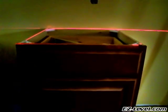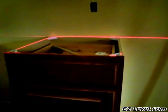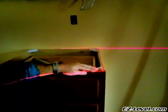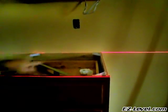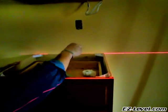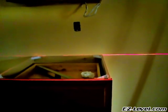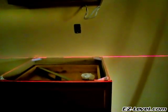Keep in mind, when we're making these final fine-tuning adjustments, I don't use the drill — I just use a 3/16ths nut driver. Keep your eye on the red line on the left-hand side. There it goes. We've just split that laser beam in half. Now on the right side — keep your eye on it. And there we go. It's showing up on the face, but we're a little high on our right-hand front corner. That's why it's not showing up on the wall. Let's bring it down a little bit. There we go. We have just split that laser beam on all four rails.